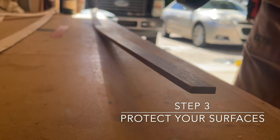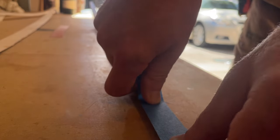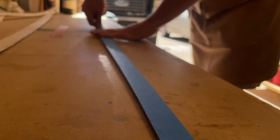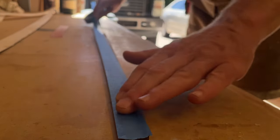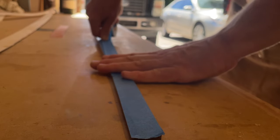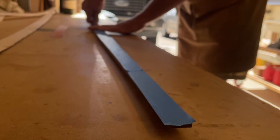Step three: protect your surfaces. If you're putting bamboo on the back of anything, the rind of the bamboo is going to pretty much repel any kind of adhesive that you put on it. You're going to remove that rind in the end anyway, so I don't spend much time preparing the backs of my bamboo. However, we cannot get glue onto the surfaces of already prepared bellies or already prepared belly surfaces. The reason is we've already taken a lot of the tillering process out in the finishing portions of the job, so getting glue on there could eventually end up in the finished product. We want to do everything we can to mitigate that potential.